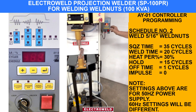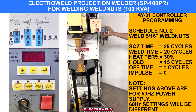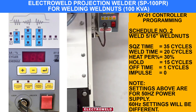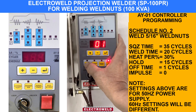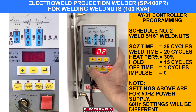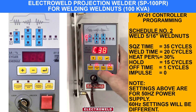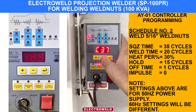This covers all the parameters of welding. Now for welding 5/16-inch nuts you can change the program. Go to schedule number 2, put this off, go to program, select the squeeze cycle — say about 35 cycles squeeze time.